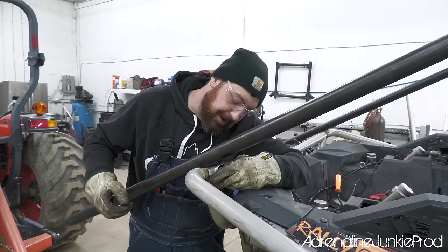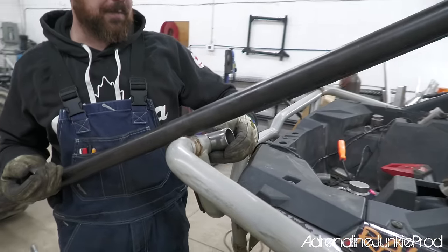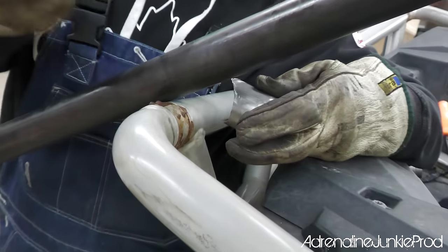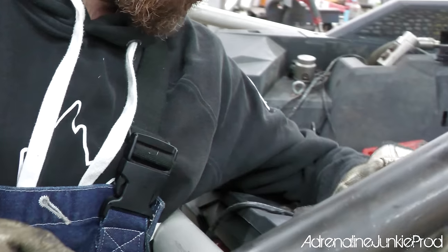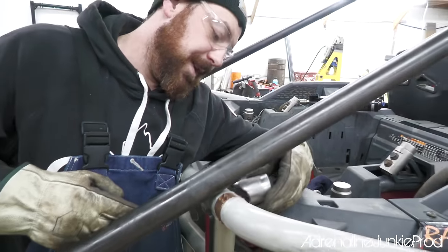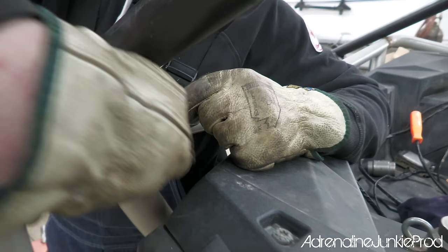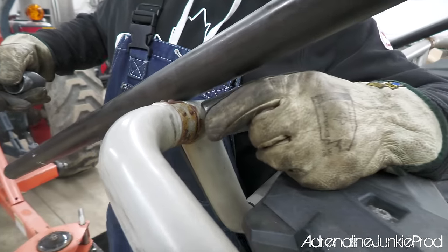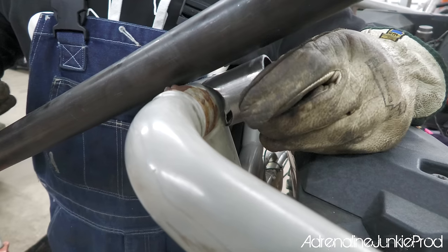So what I'm thinking here is we got a notch. That's all fine and dandy. But whenever you're notching into another piece, you actually got a back notch right there, because that's where it's gonna end up. See how it fits nice and tight like that? Well, we got a piece intersecting on the bumper here, so we actually have to notch that back right side. You gotta compensate for that piece to fit around it, right?